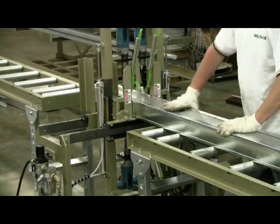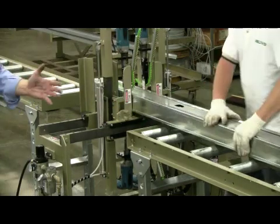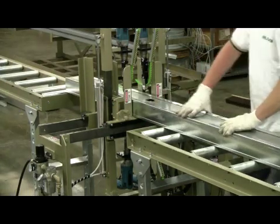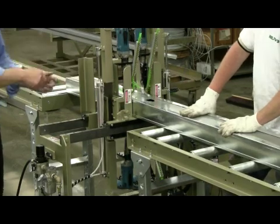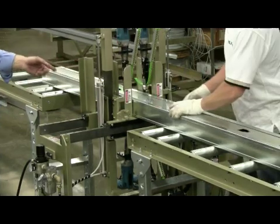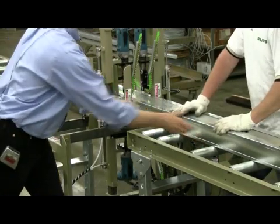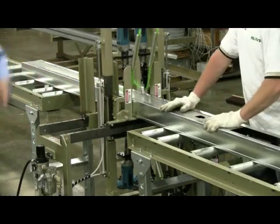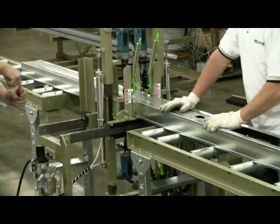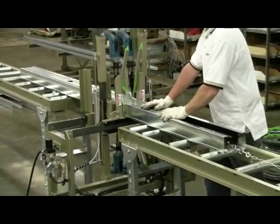He feeds it through. Normally you're going to take your plates or your channels and mark them off. What's your spacing, what's your code? Is that every 3 inches, 6 inches, 18 inches, and so forth? Make a mark on your channel. The operator can just eyeball it. Slide it through. The mandrel stays in this area, it's always fixed, and we move the material past the mandrel. The mandrel is there to maintain the size and shape and hold it, so when we're screwing through, we're not crushing the material, deforming it, and getting it out of the way.